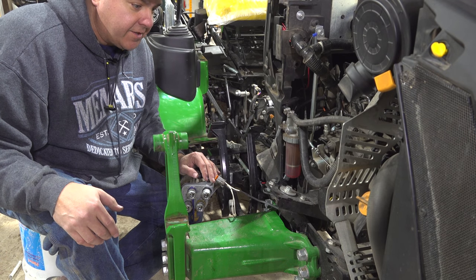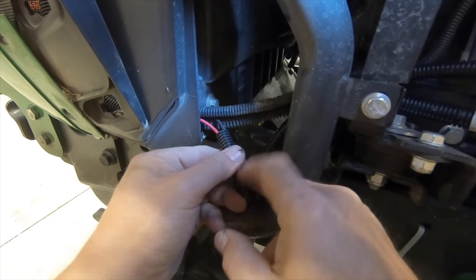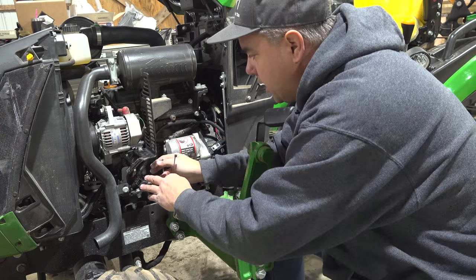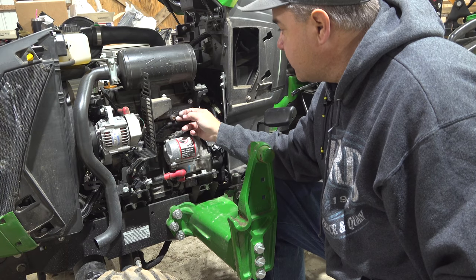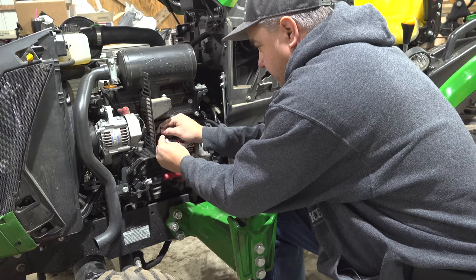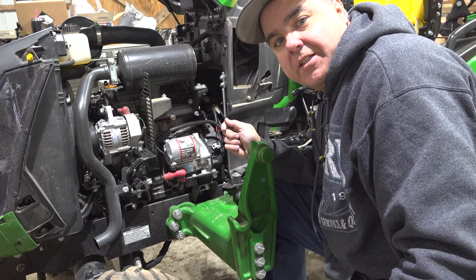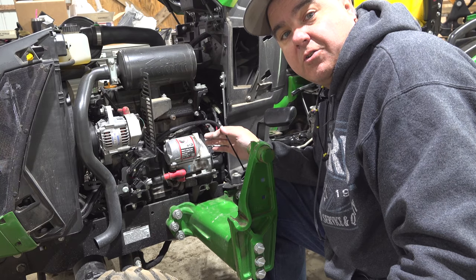Let's go to the other side of the tractor and check out the TKV-20 wiring. On the front here I went through the same hole to get up to the battery. Everything inside the battery box is the same as it was on the original TKV-20 installation video — go check that out for a lot of detail I'm probably not going to show here. This bracket here changes a little bit how the wires are run compared to the 2014. I really like to follow other wiring where possible. I feel like the engineers at Deere have taken a lot of effort to figure out where to run the wires — they're trying to avoid all the same things I mentioned, and maybe even things I haven't thought of yet. So where possible, I like to follow existing wiring.